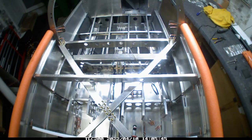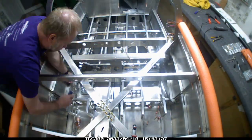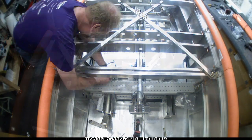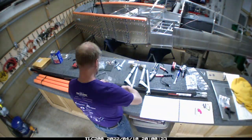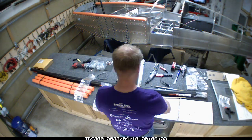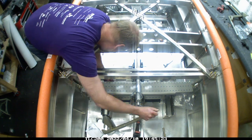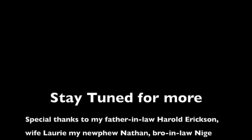At this point I'm getting the eye bolts installed, then working on getting the control rods in place, running cables, and getting serious about riveting a lot of components inside the fuselage. You'll notice the orange noodles on the top portion of the skin while it's being held in place — those are super handy because leaning over into the fuselage would get sharp on the edges after a while. I'm going through all the control points, torquing down the eye bolts and getting everything ready. The right control rod is much stiffer than the left one, which is really smooth, so that's what I'm working on next.